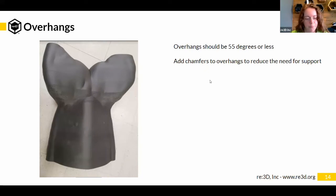A chamfer is a term used in CAD software — it's applied to an edge, like cutting off that edge. In subtractive manufacturing, imagine a cube and taking one edge and slicing a 45-degree angle along it, so it replaces the edge with a flat face. You can do this for edges that jut out on the outside of the cube, but also on a concave edge like the inside of an L. This also adds strength because it's stronger than a straight 90-degree angle.